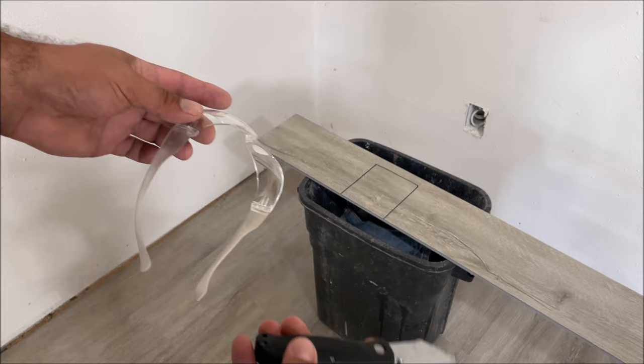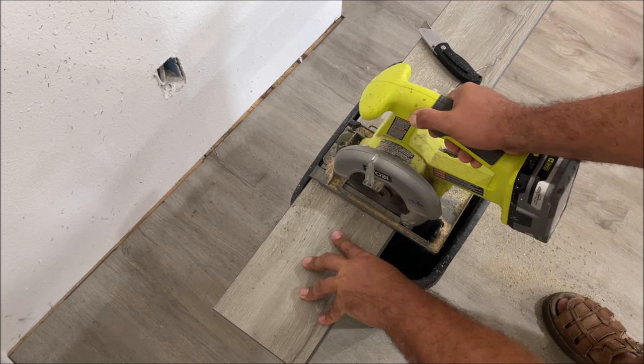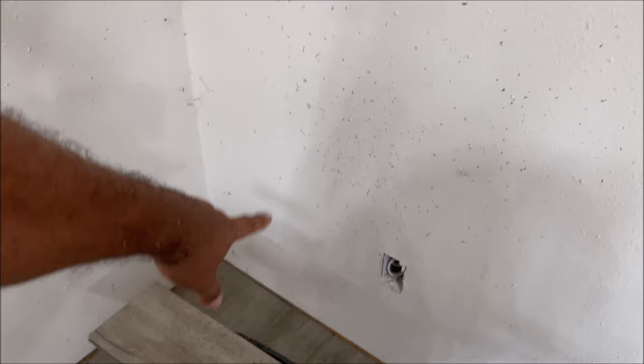Scoring a piece with the razor blade is the ideal way to cut this, but in this case we can only score one side — we're going to have to use a saw. Use your safety glasses. If you're going to cut it with a saw, do it away from where you're working because it's going to shoot little pieces everywhere. Those little pieces that got flung everywhere will go right in your eyes.